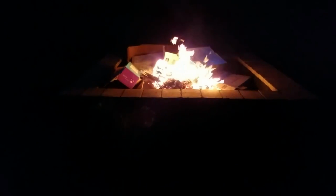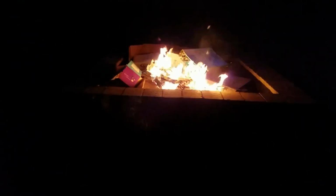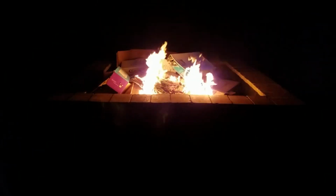Alright y'all, finally got it started. One thing I wanted to tell you, that caulking that I talked about to put that top plate on, don't do it. That stupid stuff wouldn't hold a stamp to an envelope. But what did work best was the mortar that I put the slate on, just use that. Just like you're putting slate or tile on the floor. That's the best stuff for that top plate there.